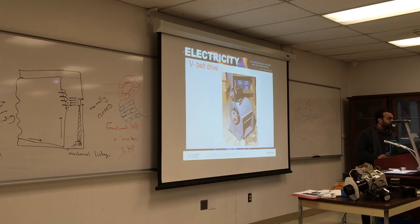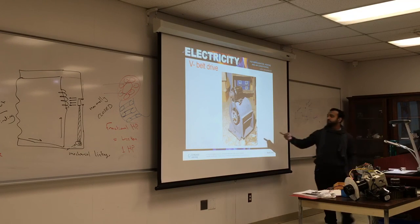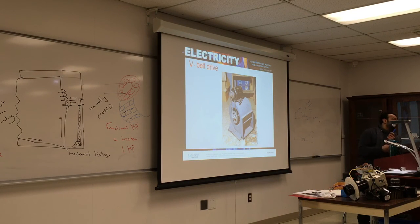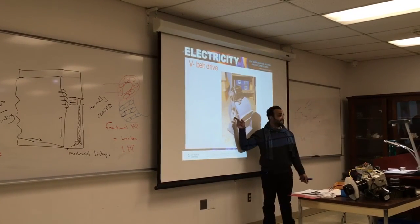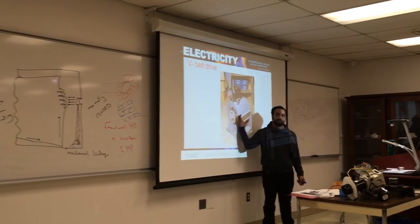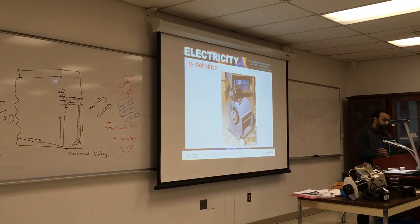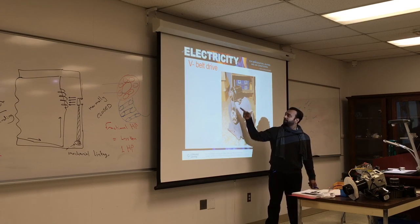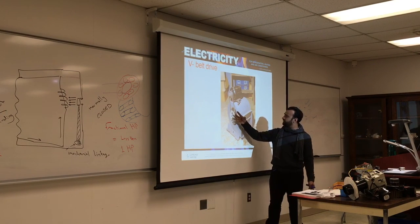Is that just a commercial application? No, actually, even for residential. You'll see this on top of your air handling unit, and this fan is supposed to push air through the entire house. They break a lot. The fan can break and the belt can break. And what will break here is the bearing. You don't change the bearing, you change the entire motor. You have to just loosen. Actually, it's going to be really tight. There's no tension here. You can take off the motor, loosen the belt, and take the squirrel cage out from here.